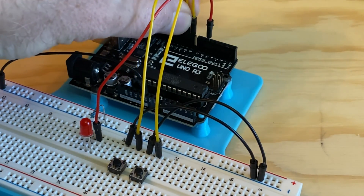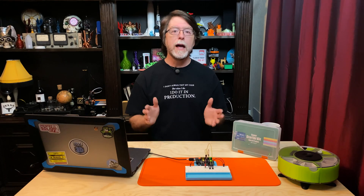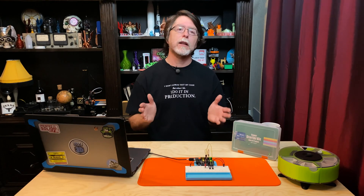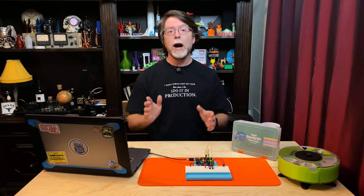Using a color code for the wires really helps. Red for positive voltage, black for ground, and yellow for the switch inputs. That way when I look at the breadboard I can tell at a glance what's what. If I have to troubleshoot I can see where my power leads are to verify they're going to voltage and ground. That's it for the wiring.